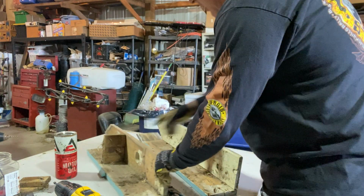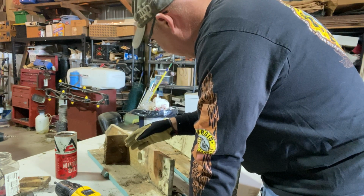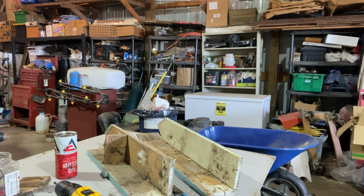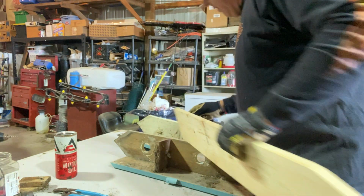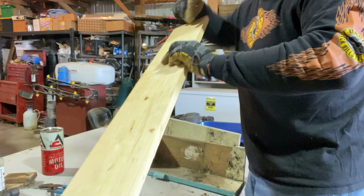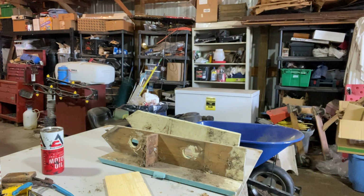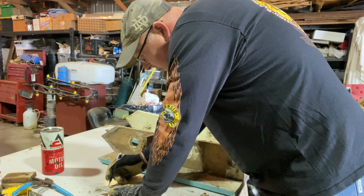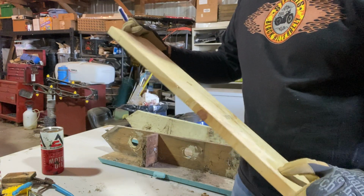The next step is we need to replace this board now. Looks like it's just, you know, a piece of 1x that was handy. So we'll just make another one just like that. Now you can measure, but if you've got the template, basically just hold it up there. Make your mark like so. Grab your square. And like that. And see if it doesn't split. You know, with this cheaper pine board, sometimes that'll happen.